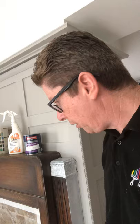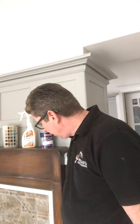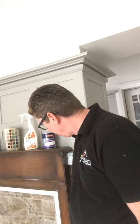And of course, where the paint is going, you really do need to tape it off. You can see where it's all taped off there. Just tape it off where the primer's going. This is getting three coats, so it's quicker, easier and tighter to use masking tape. And on the ground as well, have it already taped up. So I'll just start putting this primer on.